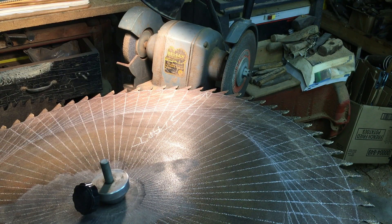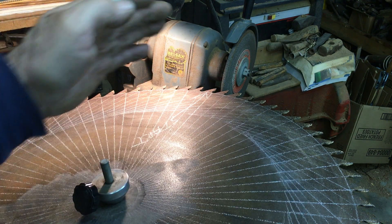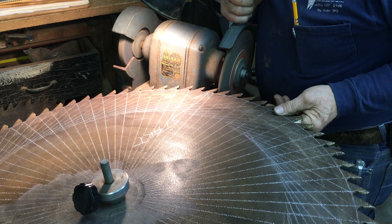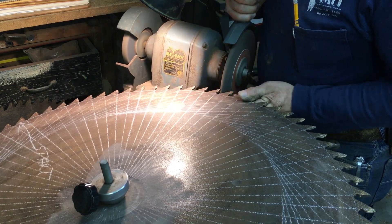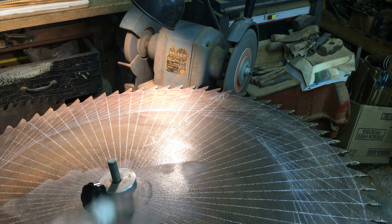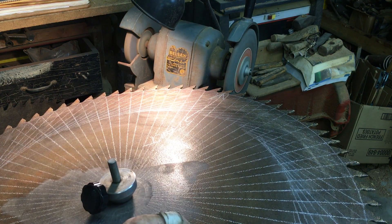Because this blade is so big — 30 some odd inches across, 32 inches or better — I'm going to try something a little different, because that was a little awkward reaching all the way across the blade. I've tilted it the other direction to do every other tooth on the other side as far as the angle is concerned. I'm going to go around the backside and try to pull that end to me instead of reaching all the way across the blade. I definitely enjoyed that a lot better — definitely more convenient to be back there pulling it through. I was still able to utilize my witness marks to make sure I was on target with the angles.